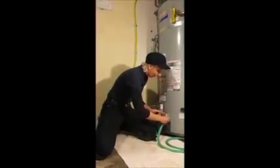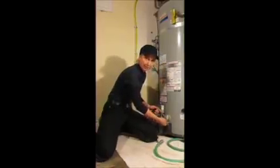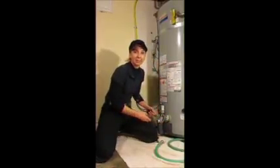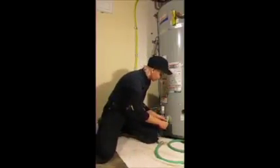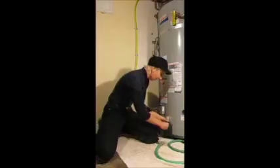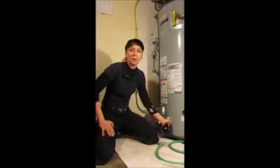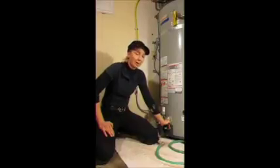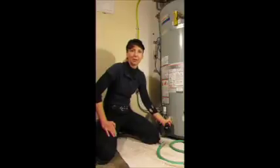So even if this valve were leaking, which is how they fail, now it would be dripping, you would not end up in an emergency situation where your water heater is going to drain all over your basement. You would just quickly thread on a stopgap measure. With $4 ahead of time, you can save yourself 50 gallons of water in your basement just in case something goes wrong.